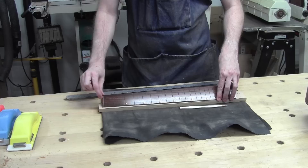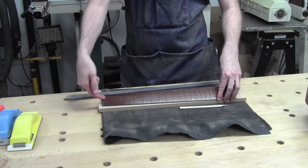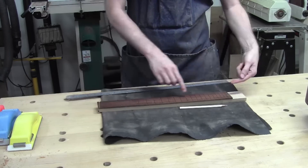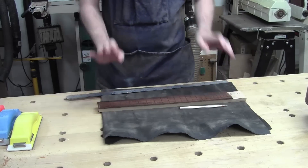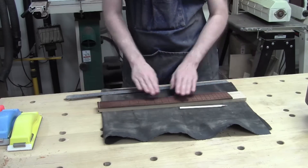Right now there's some extra material on the nut side. I'll get that cut flush with the slot, put it on the template, get the sides done, and then work on the end. Basically we're getting the fretboard to its final — pretty much final — dimensions and shape.